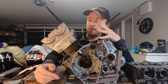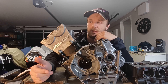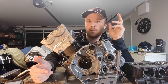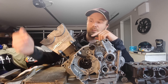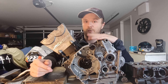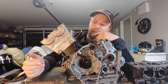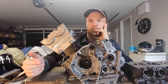This is as far as I got in today's video. I was planning on making a bit more progress than I did but that is always the way — hold ups, things break, things go out of control, and the never-ending need for buying more tools. Pretty happy with the barrel — it only needs a few more tweaks and then that's done, then all I've got to do is glue it together, make a mould and cast it. That could possibly be the next video, but I do want to get onto the cylinder head and actually machine the good head. First I need to nail those practices on the dummy head to make sure everything's going to be all hunky dory. I've ordered another couple of machine reamers which are fractionally smaller than the one I've got because it is machining a smidge oversize, and I really don't want a valve guide coming out at 12,000 RPM — that's not going to be good for anyone's wallet, or if they crash, my bones. I'll be riding it — I don't want that.